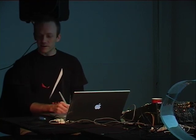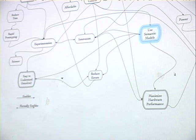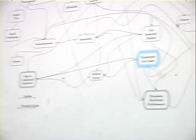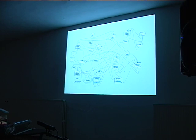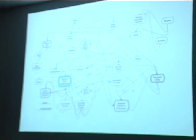Another thing that we should really think about is how to reduce errors, because people are learning and experimenting, and mistakes slow that whole process down. One way to reduce errors is to think about semantic modeling, and I'm going to talk about how this plays into Micro OSC and how we use semantics to describe the circuits and sensors. Semantic modeling is basically accomplished by enumerating all the scenarios that you expect this thing to be in and figuring out what's common and how to describe them in a succinct manner. And all that ends up creating these user-friendly interfaces, one of which is normalizing the numerical representation of data, for example, using SI units, and I'll talk about that a little bit later. Finally, the holy grail for the whole project is to eliminate microcontroller programming, because it's really horrible.